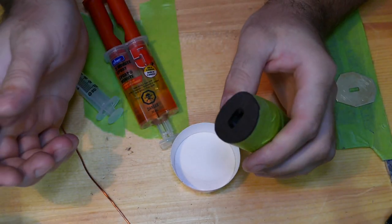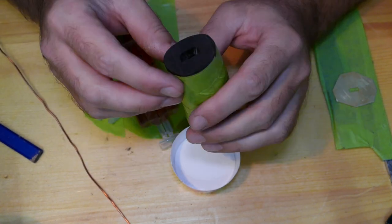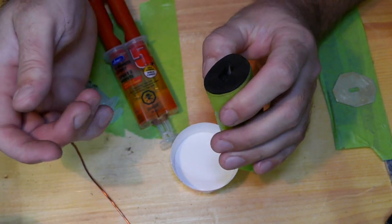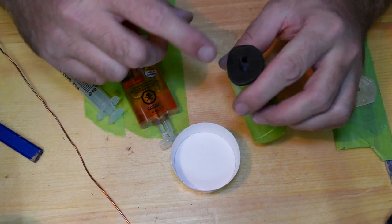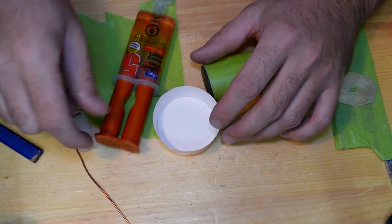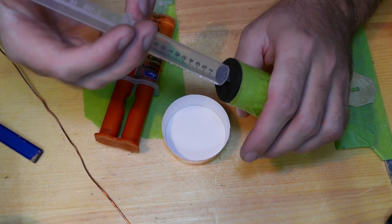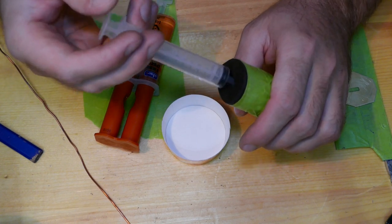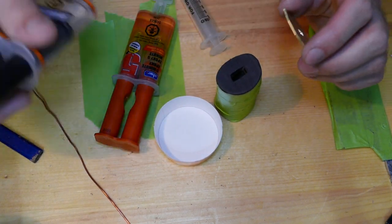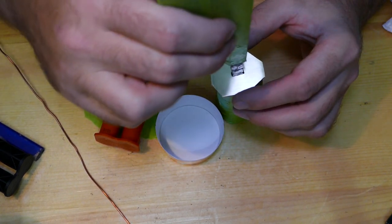Okay, so what's the plan, guys? Since there's quite a large hole inside this handle, which is kind of my fault, but you live and learn, right? Anyway, to fill that, we're gonna use this cheaper epoxy. I'm gonna mix it in this cup, and then I'm gonna use this syringe to suck it in, and then we'll put everything inside. Then to glue this brass part, I'm gonna use this good epoxy, which I trust already, and then we'll install our knife.